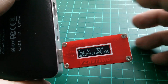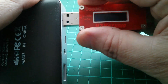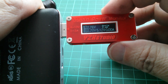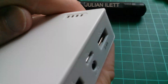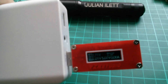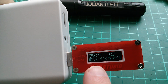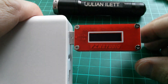Both sockets on the i-Smart power bank are saying Apple 2.4 amps, showing 2.75 volts on D+ and D-. The other socket also reads about 2.75 volts, identified as an Apple 2.4 amp socket. Now trying a Vantec with smart ports - both labeled 2.4 amps - and this one is slightly different, saying Apple 2.1 amps with 2.7 volts on D+ and 2.0 volts on D-. Let's try the other socket - this power bank needs to be manually switched on.